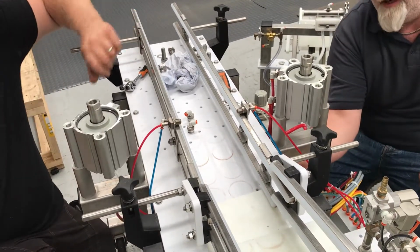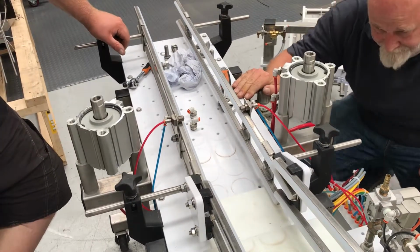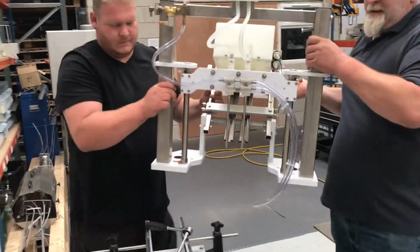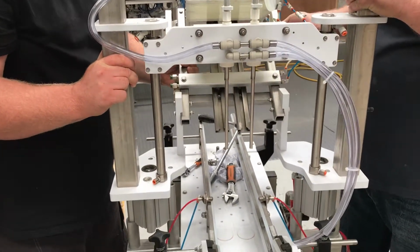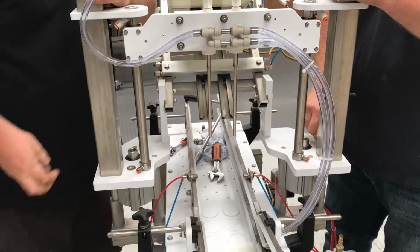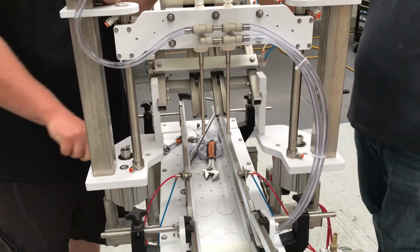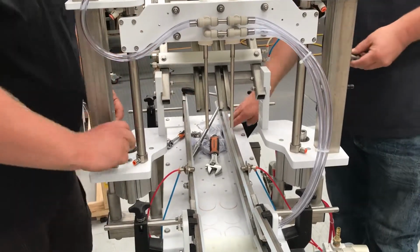And the reason we do this is it allows us to adjust the position when we put everything back together. Okay, bolt in hand. Lift. And when you lower it on, make sure you square and you don't knock the oil seals out if you can avoid it. There you go, drop it in place and then just quickly put one bolt in, finger tight. It can't fall off now, it's stable. Put the rest of the bolts back in, tighten them up.